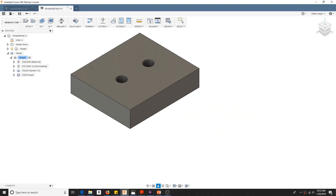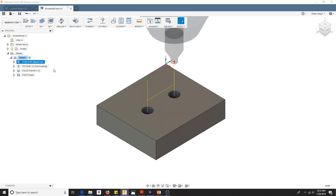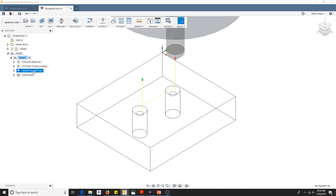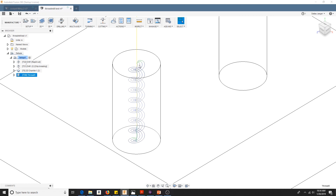I had already ordered a couple of thread mills for the job so I figured I might as well give it a try. Here's what it looks like in Fusion — just a simple cube with dimensions matching my rough stock, about 1.4 by 1.63, three eighths thick. From there: center drill to just kiss it, grab a number seven drill bit and peck at it a little bit, chamfer the top, and then do the thread mill. That's what that looks like.